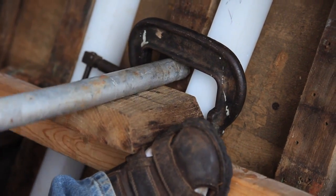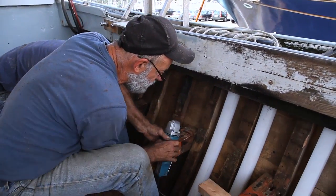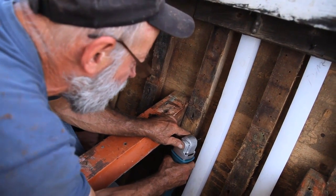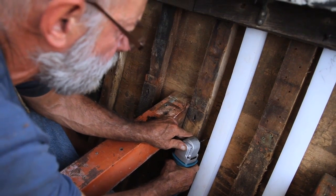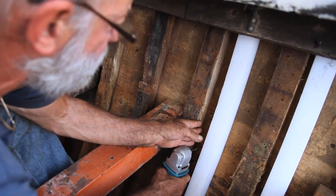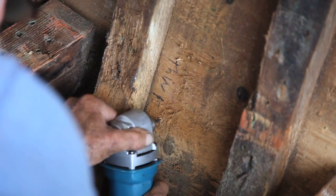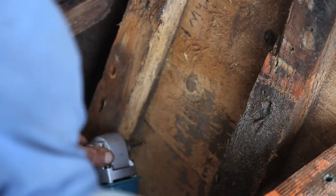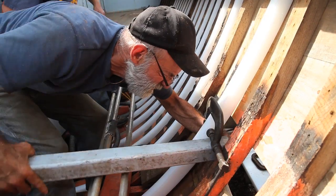What I'm going to do now is move the plastic frame a little bit aft of where it's actually going to be, because I'm going to drill a few holes from inside out so that I don't have a big struggle trying to find the holes on the outside of the boat. This frame is going to be close to a half inch away from this wood frame. I'll drill a hole just an inch away from the frame and about an inch away from the seams, and we're going to do every single frame on this side at the heads.